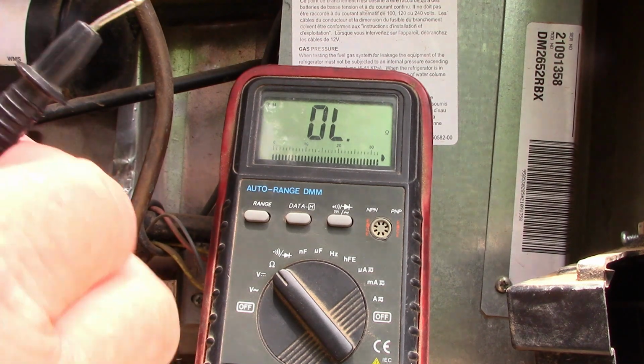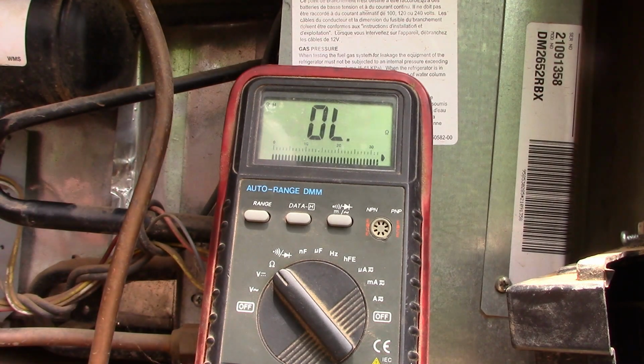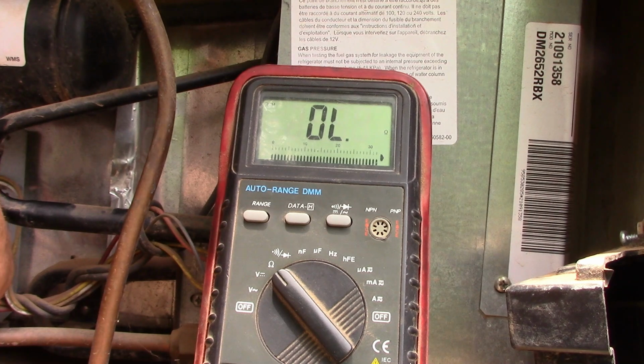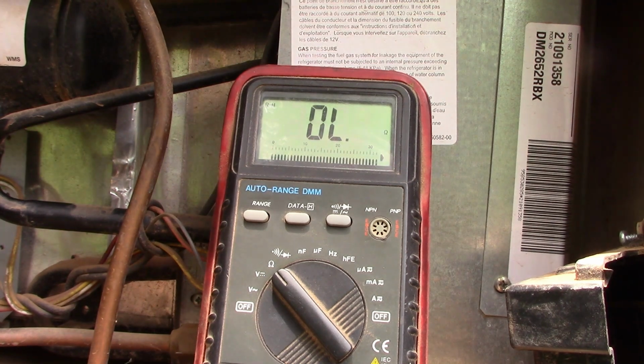So what we want to do is make sure this does work. We'll cross that over and you see numbers. So we're good for now. We're not worried about that 8. All we're trying to do is check this probe out real quick. So let's put our fittings, or let's put that there. Put that there. Guys, look at that. Nothing's changed. That means the thermistor is bad.